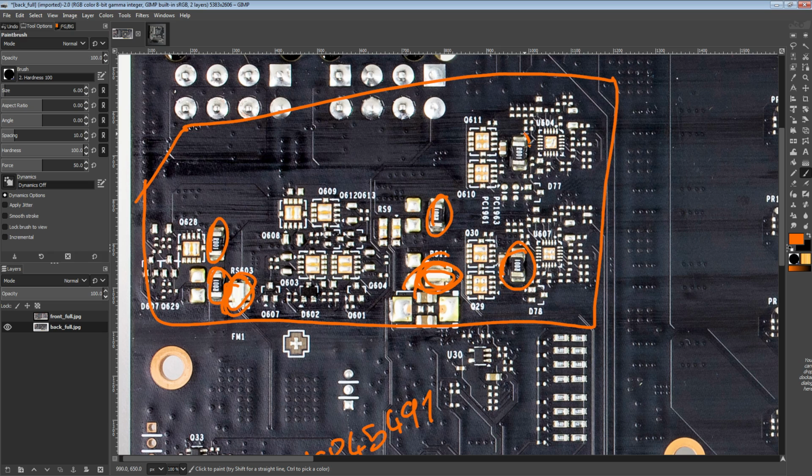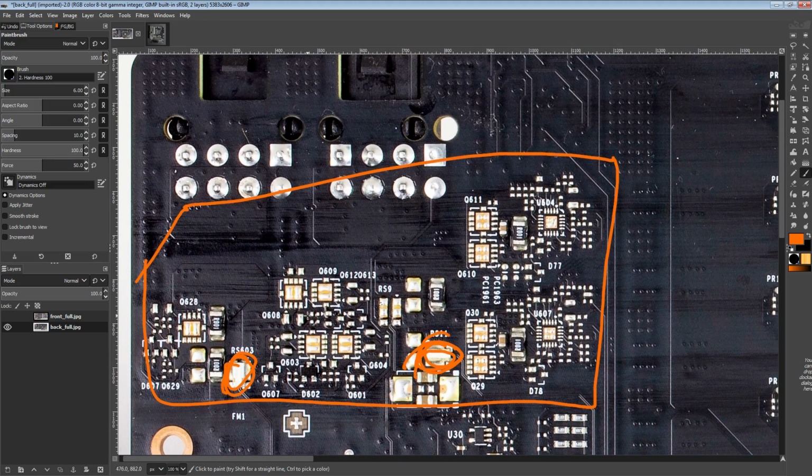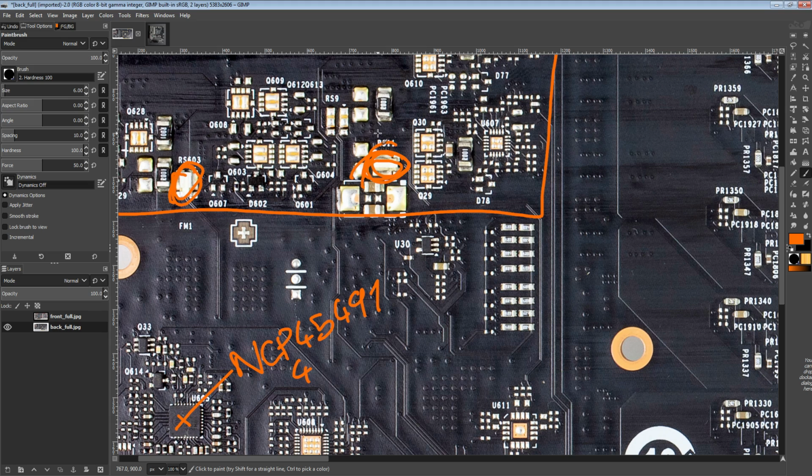So yeah, that could potentially translate into much easier power modding on this card. At least that's my theory. It might be easier to remove the power limit on this. Because basically, as I was very late to realize, the thing that really screwed me over when I last tried to work on a 2080 Ti was all of the current balancing circuitry.